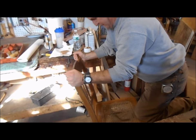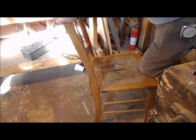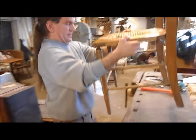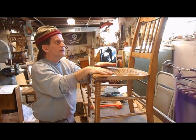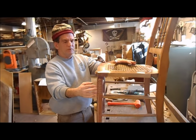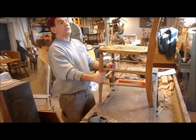You can basically see that this chair is loose in different ways and really is a candidate for complete tightening. In order to truly repair a chair correctly, it must really be completely disassembled and completely re-glued. Sections of chairs can be done, but it's really advisable to do entire chairs so there are no areas that will come loose long after you've already repaired part of the chair.